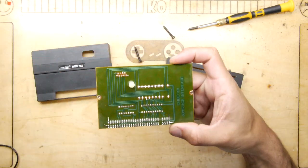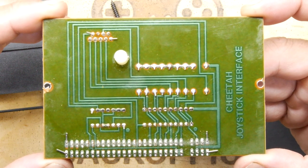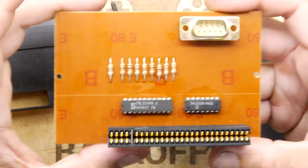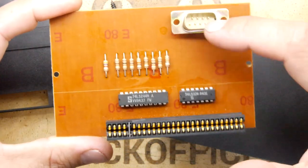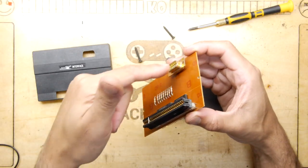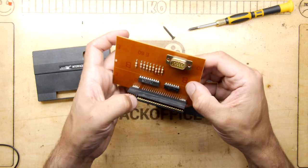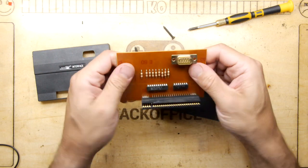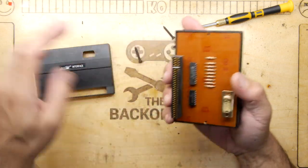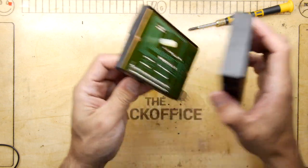Looking at the parts on this — if you wanted to replicate it yourself, here you go, I'm going to hold the circuit up. It's nice and simple — take your screenshot now. You've basically got everything you need right there, nicely hand-drawn, tells you literally everything you need to do to make this again. In terms of cost, I suspect the costliest parts are going to be the connectors, since connectors are expensive and any I/O is expensive. But the chips are virtually free — I'd expect to pay no more than about three pounds for those two chips combined. Have a look on Digi-Key or RS.